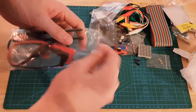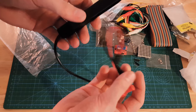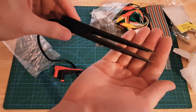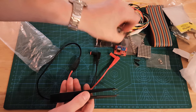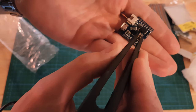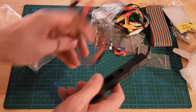And these are for my multimeter. Pair of power leads, positive and negative, which actually go to a set of tweezers. And ideally these are for SMD, surface mount components. And you can check various things like diode polarity, or you can check continuity or resistance. And instead of having to stick your probes in, you just tweezer. See, for example, you would tweezer that there, or check this LED, just tweezer in between there. Yeah, very handy. And again, this was less than £2.